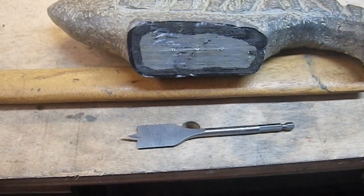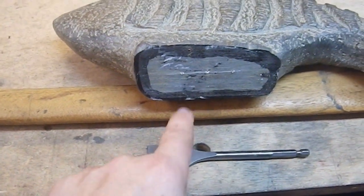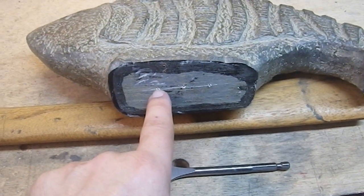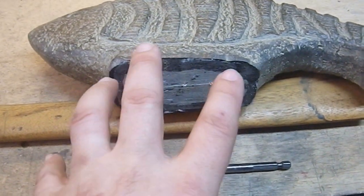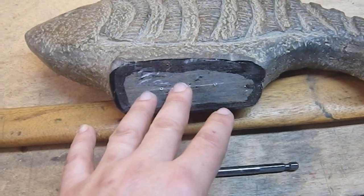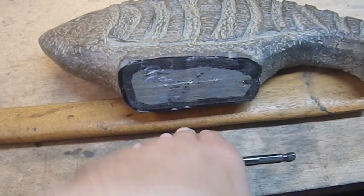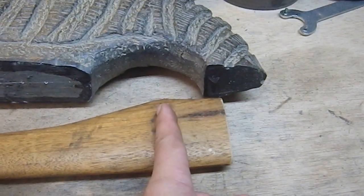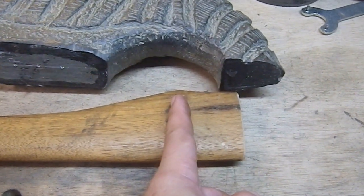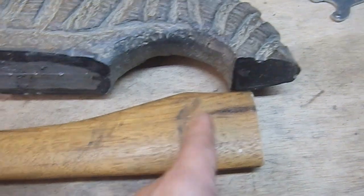I was wrong — I am going to be using a spade bit, because it's the bit closest to the dimension I need, which is 15-16ths. I'm going to drill three 15-16ths holes, which will leave me a little bit of peaks in the middle. I'm going to use those peaks to help provide physical guidance. I need a little bit of snugness in there so I don't get a lot of slop. This is not an actual weapon — this is just going to be a showpiece, so it doesn't have to be uber stable, just stable enough.